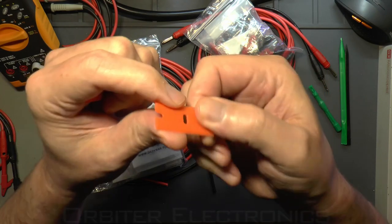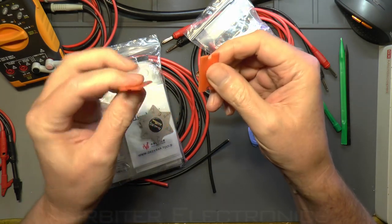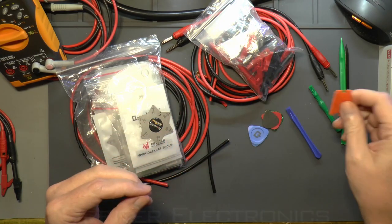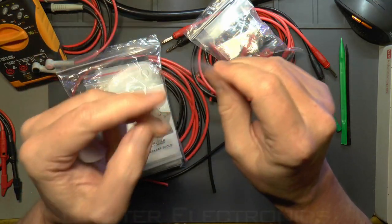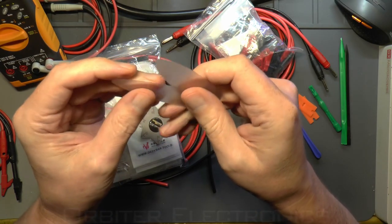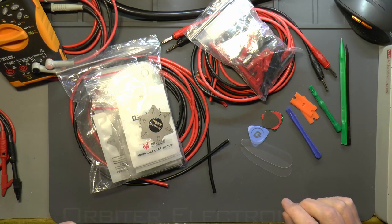Then there are other varieties like razor blade ones — they've got two sharpish edges and these are good for scraping plastic off screens or the gaskets that go behind screens. These are good for digging that out if you don't want to use a screwdriver. You're always best using plastic because there's less chance of causing damage. Then there are very flimsy teardrop things — these are good for getting behind screens but literally only good for a couple of uses. They're very thin, probably 0.4 of a millimeter.